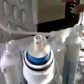Your RO filter casing should come right off. To take the top off, you twist it off counterclockwise. I'm removing the top so I can put in the membrane. It should be empty just like this. Drop the membrane in place, then use the cap to tighten it down or push it down, and then screw it in.